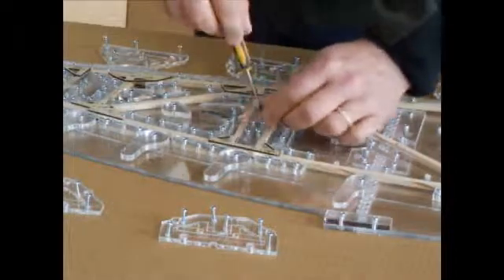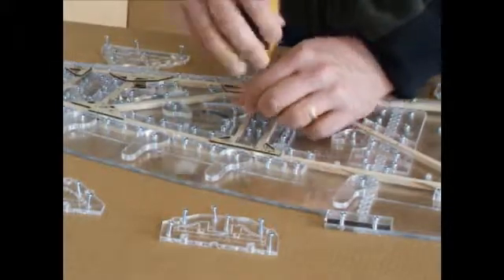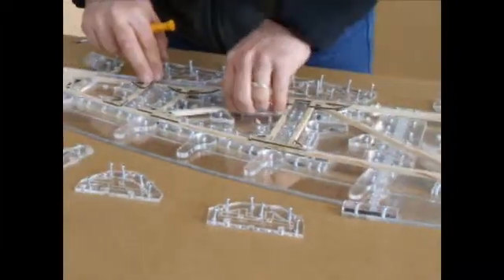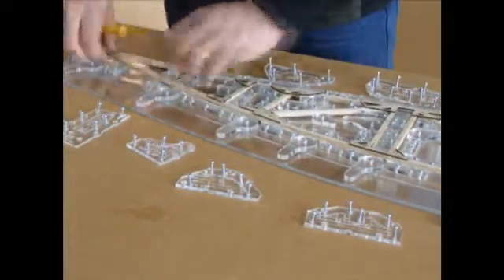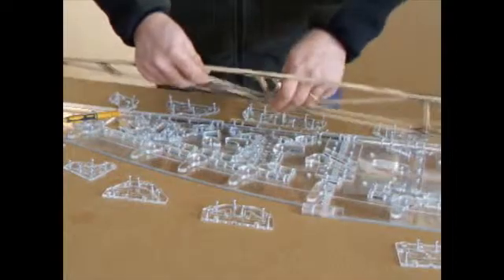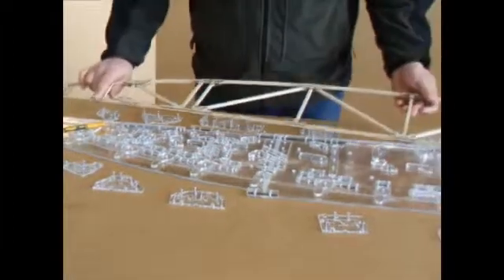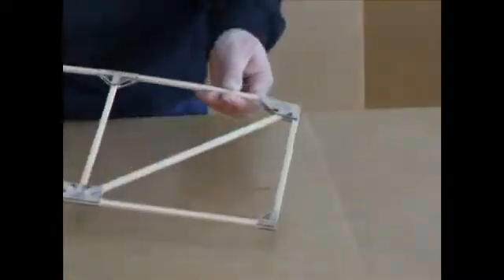In this case I also have to remove 37A and 37B as well. Once you have the wing rib out of the jig, you can then remove any parts that are stuck. There you have the wing rib removed from the wing rib jig — this is a completed wing rib.